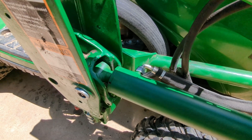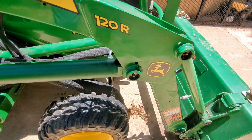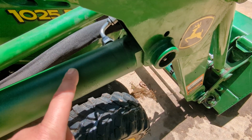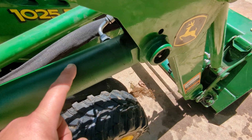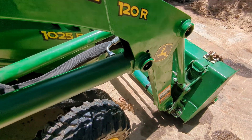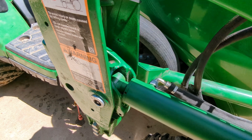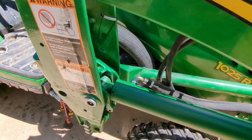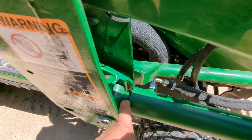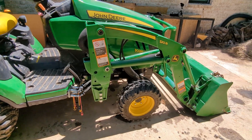You can see right here we have interference — that is a limitation that this tractor is going to have with the quick connect. The factory ones, since they're only 1.5 inch bore, they're just about 1.8 inches, and that's about how much room you have between here. The challenge is on this side your bore is bigger than your tang there, and on this side there's no way around it since this is the actual bore. The only way around it would be to shorten your range of motion. On this 2 inch one, you've lost just a little bit of range of motion, just by the fact that it will not go any shorter.